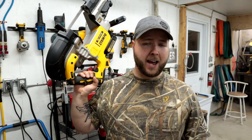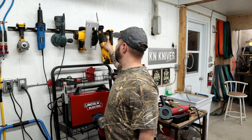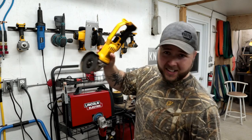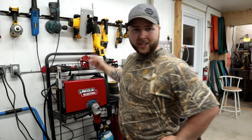When it comes to cutting steel, you basically have a couple of options. You can use a reciprocating saw, which with a good steel blade works quite well for different cutting projects — good for exhaust pipe and stuff like that — but I don't enjoy it for cutting angle iron and flat bar; it's messy, it moves around a lot. Of course the bread-and-butter option is the angle grinder. I like to have multiples with different wheels set up — a flat wheel, grinding disc, cutting disc, wire brush — really handy so I'm not always switching out.